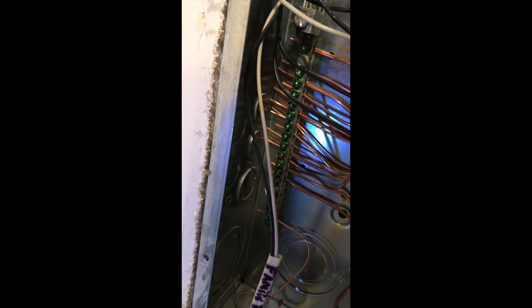I figured out my wiring configuration. This is where the box is going to go. I drilled a hole just to check what's in there — it looked like it was empty. There's a stud going right here. I put a little boroscope camera in there just to make sure there wasn't anything unusual, like pipes. Nothing picked up on the stud finder even with metal detection on. I just wanted to make sure before cutting big holes in the drywall. I'll end up coming in through one of the knockouts down here, so I'm going to cut a hole in the drywall.